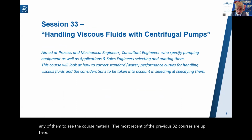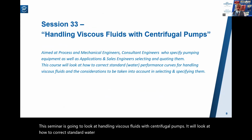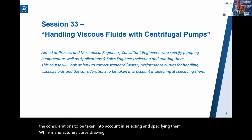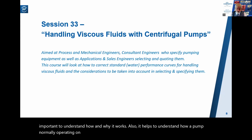Well, this seminar is going to look at handling viscous fluids with centrifugal pumps. It will look at how to correct standard water-based performance curves for handling viscous fluids, and also the considerations to be taken into account in selecting and specifying them. While manufacturers' curve drawing programs automatically correct for viscosity, it's important to understand how and why it works. Also, it helps to understand how a pump normally operating on oil at, say, 10 centistokes will behave during startup with cold oil at, say, 100 centistokes.